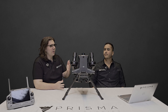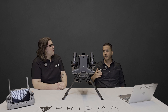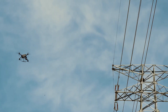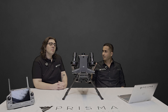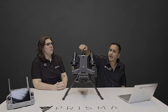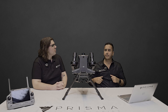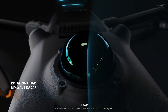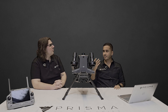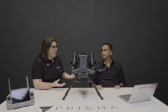I can see a few other things different with the airframe — is that a LiDAR up there? That's a horizontal rotating LiDAR. It excels at long range and detects very small objects. It's ideal for picking up power lines at a distance, supplemented by the drone's augmented reality system that will notify you of an oncoming power line. We've also got millimeter wave radar built into the front shell of the aircraft and on the arms, as well as omnidirectional fisheye full-color obstacle detection cameras. All these systems work in tandem to detect obstacles and provide safety even in low light conditions, giving you 24/7 protection. They also supplement vision positioning in GPS-denied environments.